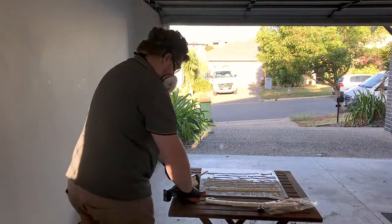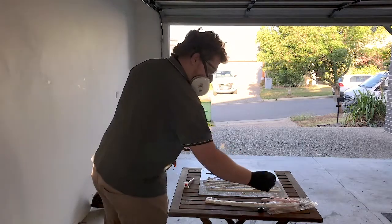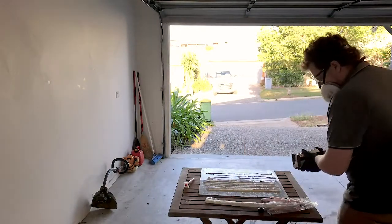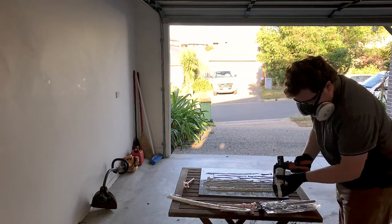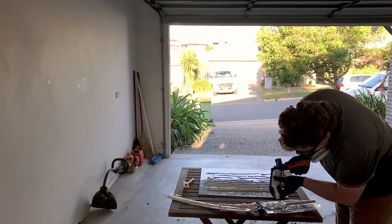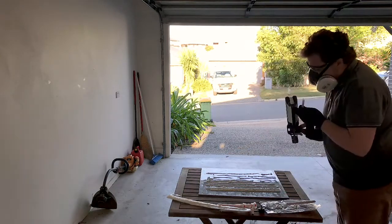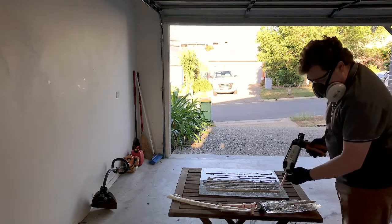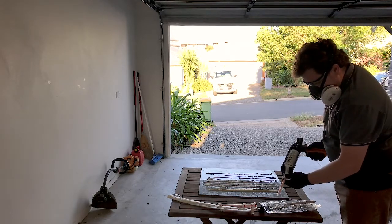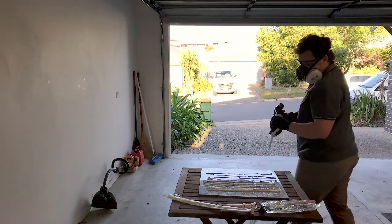So once again, this entire video has been taken using only one cartridge of glue. All these beads are coming out of the same cartridge. So what I'm about to do now, after I've just had a patchy cure, I've just had a bead go yellow on me by using bad processes, is use the correct processes again. So purging correctly, which will allow the plungers to level out and reset height. Let everything relax and come back into the happy zone, and I'll put another bead down and prove that even after having some poor results, if you go back to using the correct procedure, even on the exact same cartridge of glue, you'll get the correct results again.